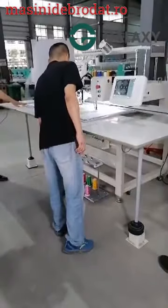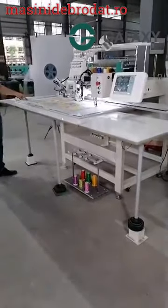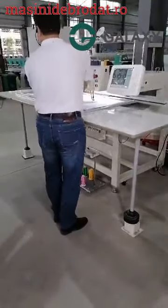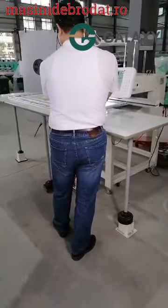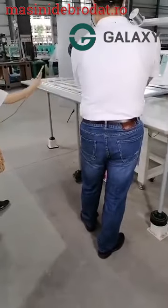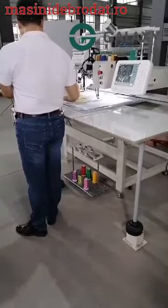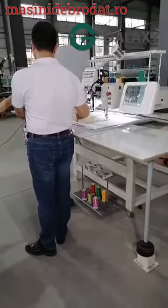This pantograph area is 1350 from edge to edge, 1300, you can see. You can measure here the pantograph area or the frame area, rail area, 1, 3, 5. This is the area inside the pantograph. So this is the frame area, working area 120. And the Y area, as you see here, is 600, means 60 cm. So we can do designs up to 550.